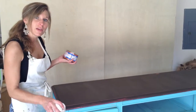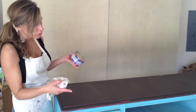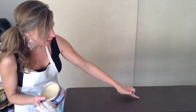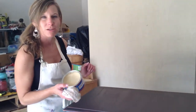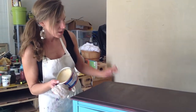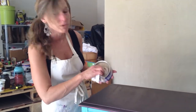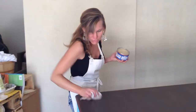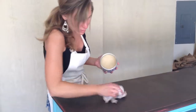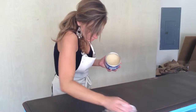So if you're going to give this two coats of wax on the top like I'm doing, make sure that you buff in between steps. You'll know it's ready to buff when it is a little bit murky in appearance, a little bit misty looking, kind of frothy. So you're going to go ahead and apply the second coat after you've buffed. And you can see it's really looking nice. It'll soak up in the wood pretty nicely too.